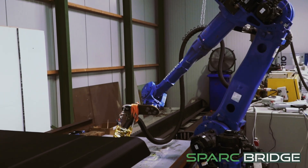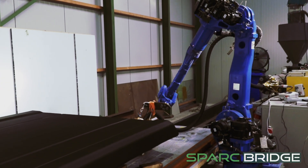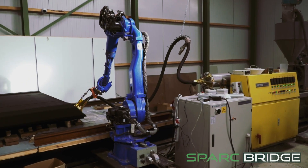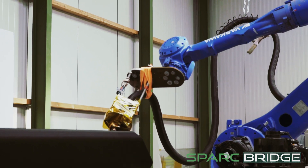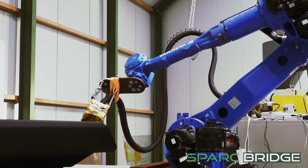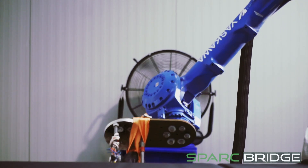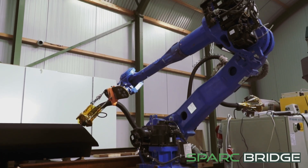The Spark Bridge is a fully circular 3D printed bridge. We process plastic waste into a compound. During this process, glass fibre will be added to the plastic waste to optimise the mechanical properties. This results in a new glass fibre reinforced thermoplastic material.